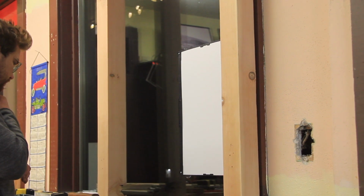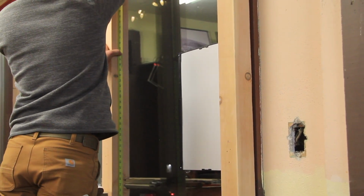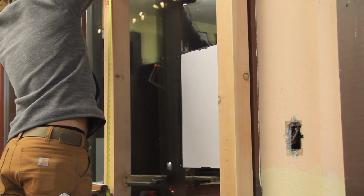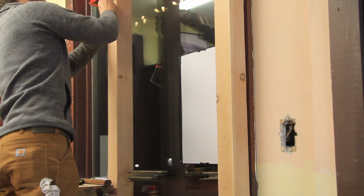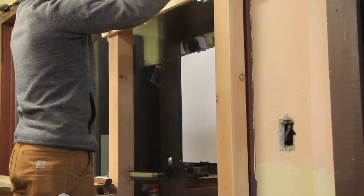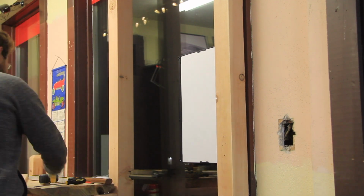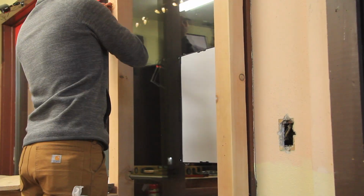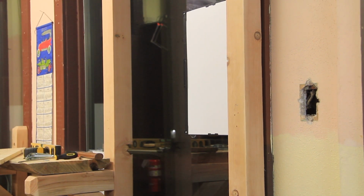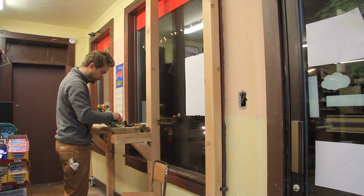We had to move one of the shelves. I put it at a weird height and it didn't really make sense, so we adjusted it later on. But that wasn't too difficult, as I just needed to patch the holes, and pre-drill some holes for the hardware that attaches these little steel shelf brackets, or shelf support pieces, that I picked up at the hardware store.